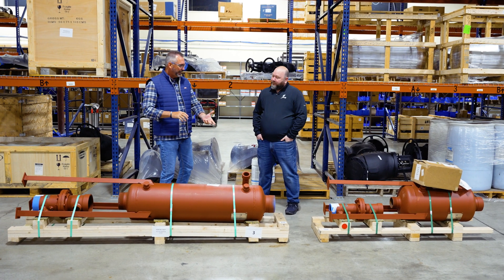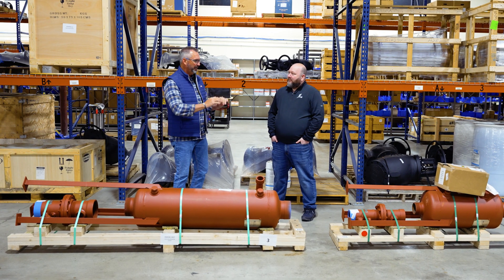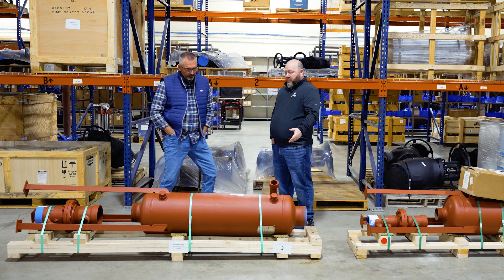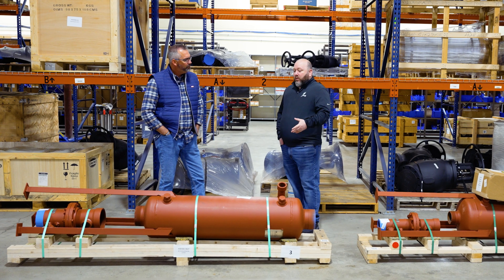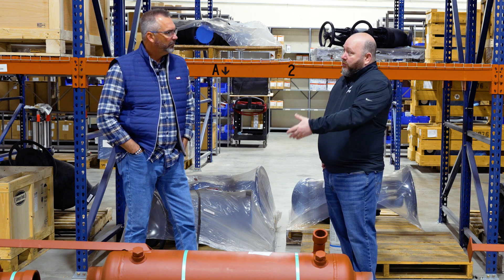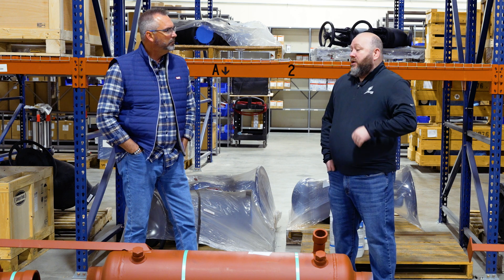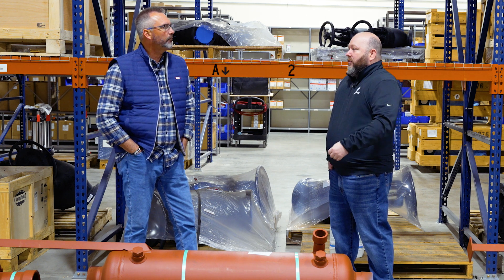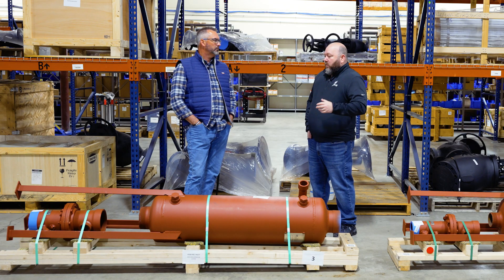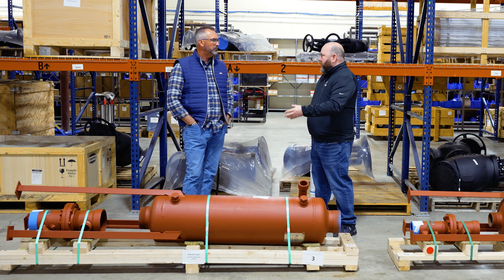I wanted to talk a little bit about how they work, but then let's move into some sizing and things that you get asked about. So of course, this is a blowdown separator. The point of having a blowdown separator is to have a place for the blowdown — the intermittent blowdown on the boiler — to be cooled before it goes to a sewer. That's really the main purpose: you're blowing down the boiler, getting the sediment out, taking care of the conductivity in the boiler, getting all the filth and junk out of it, and giving it a safe place to go to drain and making sure it's tempered right for that drain.